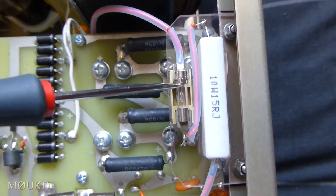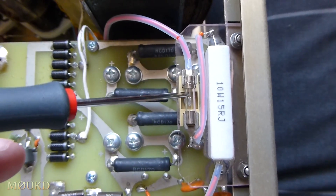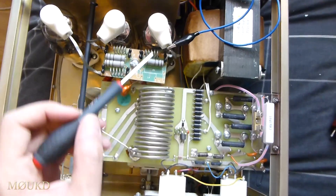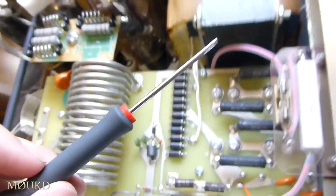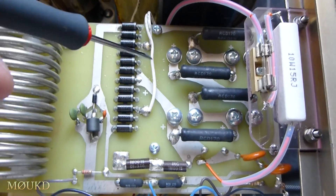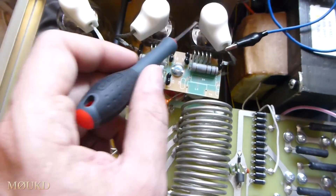The point of the resistor is this is only a 240-volt fuse, so it could technically arc across once it's blown or as it's blowing. So the resistor is in there just to limit the current. That's mounted on a bit of Perspex screwed onto this brace. So if anything does go wrong inside the valves or anywhere else in the power supply — because there's a lot of energy stored in these capacitors — there's a lot of current available for a short time, and that's what can cause this kind of damage.